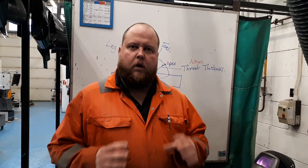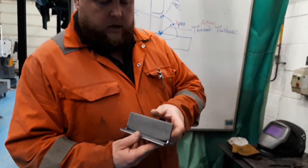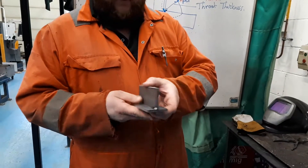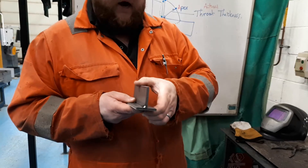There's a misconception between when I say a T-joint — people often refer to it as a T-fillet. The difference is that the fillet is the type of weld going into the joint, and the joint itself is a T-joint. So this is the joint style we're going to be looking at today. We're welding on the bench, so we've got our horizontal plane and our vertical plane — that's called horizontal vertical, position PB.